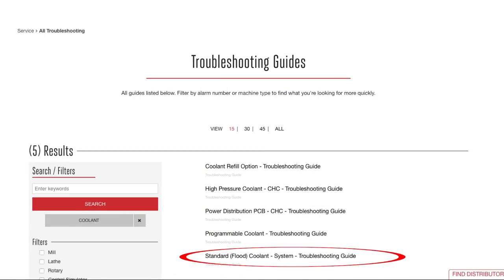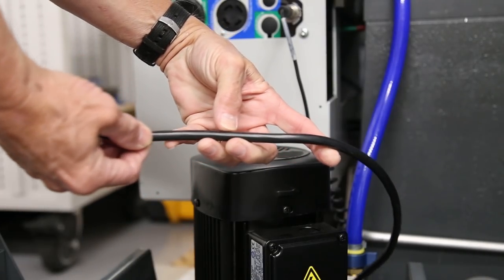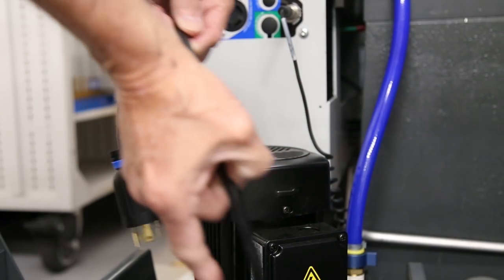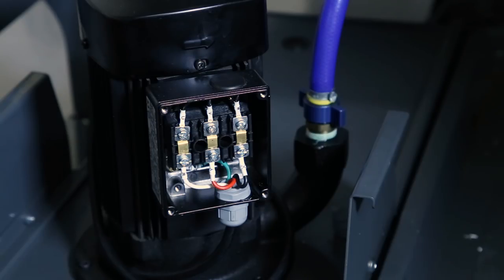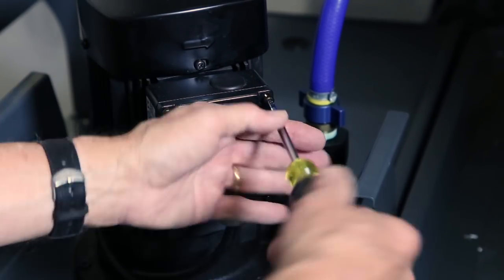Examine the power cable to the pump itself — look for loose, frayed, or damaged wiring. Open the junction box in the pump and look for burned wires and check for a burn smell. If it seems like something got burnt, there's probably an issue with the pump motor. Otherwise, make sure the wiring is tight and that nothing is disconnected. Put the cover back onto the pump J-box.